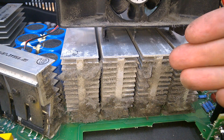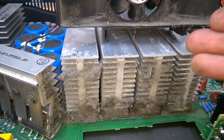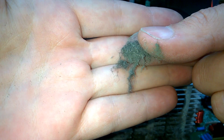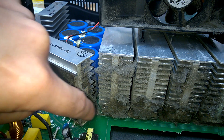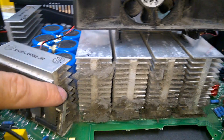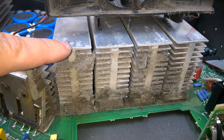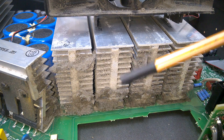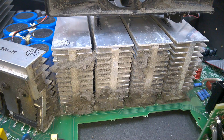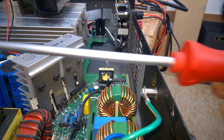Here is what I guess is the main cause for the failure — dusty. There was not enough fresh air going to the heat sink, and we are about to have the same problem here. That's bad. I always recommend my customers to do a cleaning process on these amps.